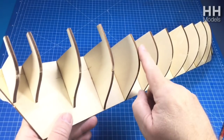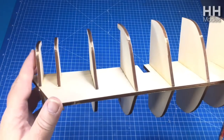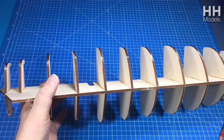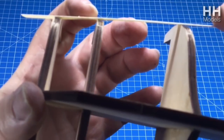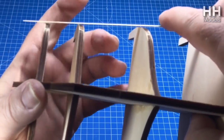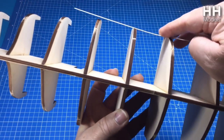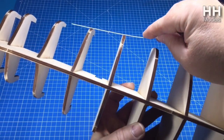One thing to do at this point is to prepare your frame — to 'fair' it. If you look sideways on, these formers aren't very wide, probably only about five or six millimetres, and they're flat. So if you put a plank on there, one side is touching and one side's floating in the air — there's no way it'll sit flush. Back at the midships where they're basically all the same size, the plank sits nicely and flat. But as you go towards the bow or stern, you've got angles.